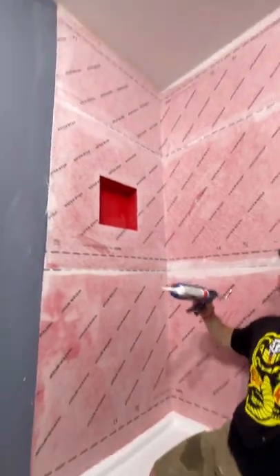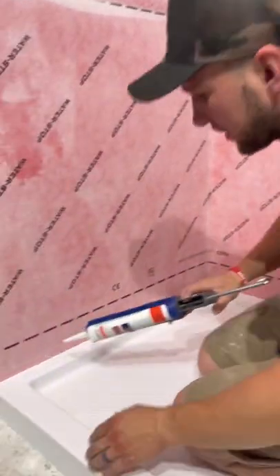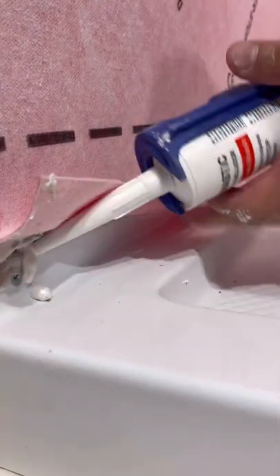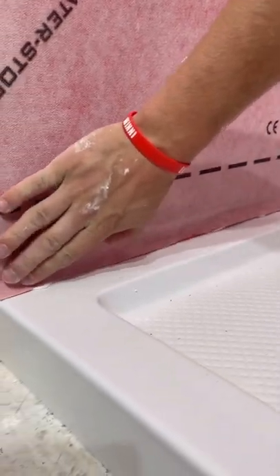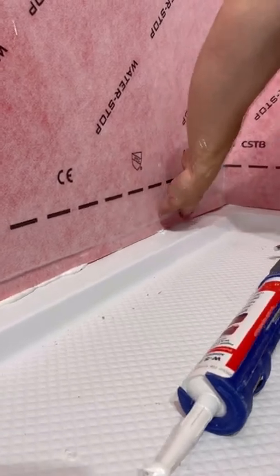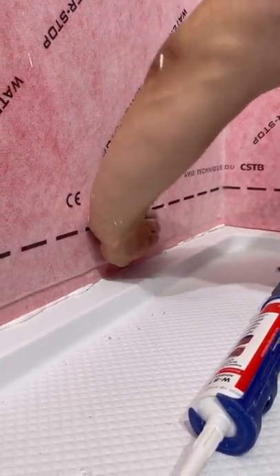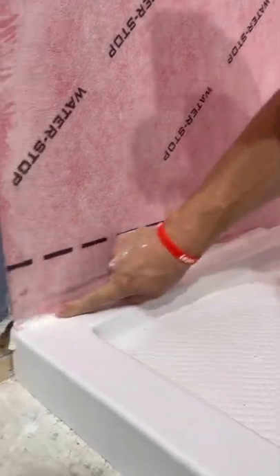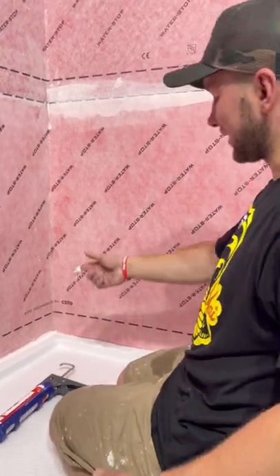Our walls and our niche are a hundred percent waterproof. The last thing we have to do is get the adhesive sealant that comes with the shower system and fill behind here — you can see there's room to get the sealant in. We fill this entire area, put our fingers in, and collapse it. As long as that membrane is touching the sealant, it is a hundred percent waterproof. You can wear gloves if you want. Once it dries it's easier to clean up, so don't get crazy about cleaning it right away. Then just continue that around the perimeter and you're done.